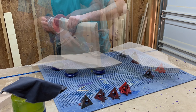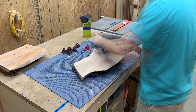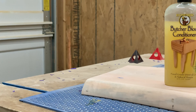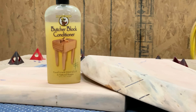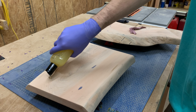I'm using plywood for the rails here because I have a small scrap piece that is perfect, but you can always use something like 2x4s. The only requirement is that whatever stock you use it needs to be perfectly flat so that the router can track perfectly over the sled. If these rails aren't flat your router sled won't work and your slab will still be cupped or twisted.